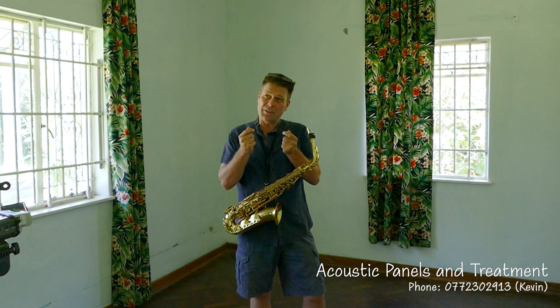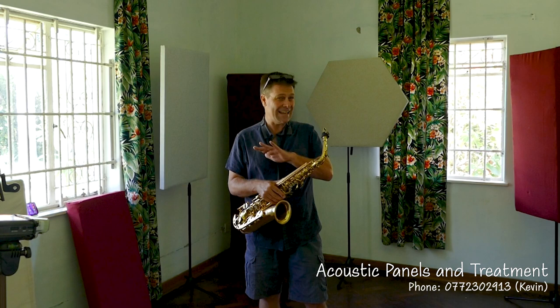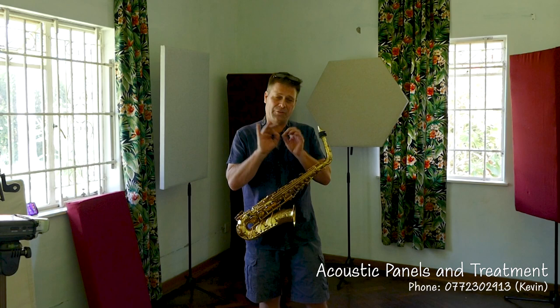What's interesting is that the room will also be quieter outside, because the panels are absorbing a lot of the sound energy in the room — they're actually converting sound energy into heat energy. Because of the law of conservation of energy, energy can't be destroyed, so it gets converted from one form to another — from sound waves into heat. Very minimal of course; this room has not become a sauna because of that, but that's how it works.